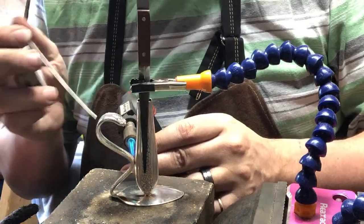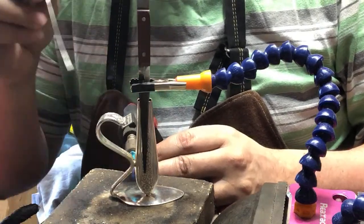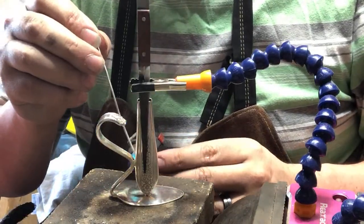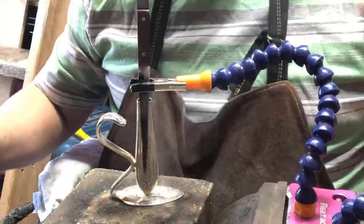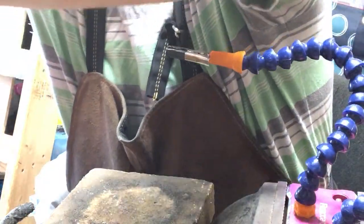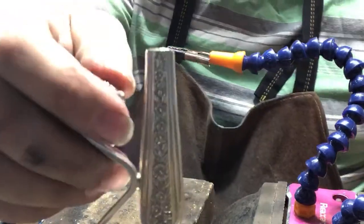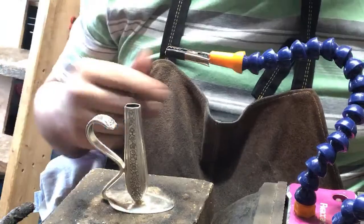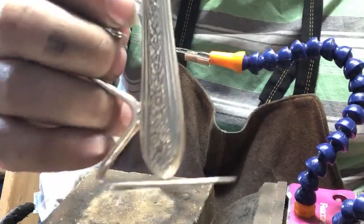Now I don't really want the blade, not blade, but the flame touching the solder. Always give it just a second to make sure that the joints are solid enough to move it. I have moved it too early before, and then you have to realign everything. So, another good joint here. I don't have any flowers or anything, but it works, and it's watertight, which is nice about these when you're using the whole piece at the end.